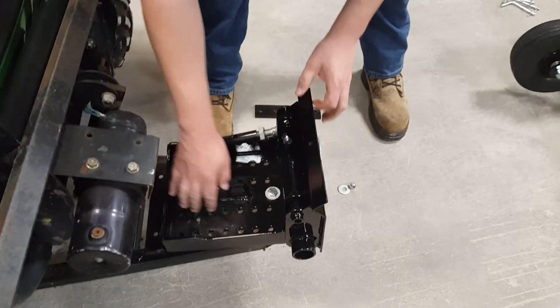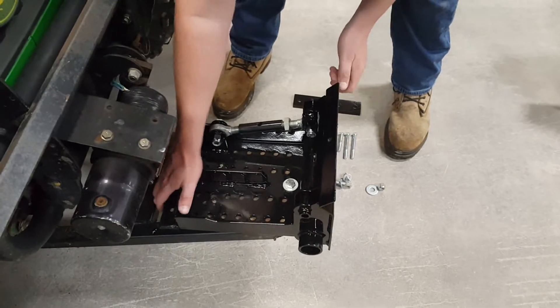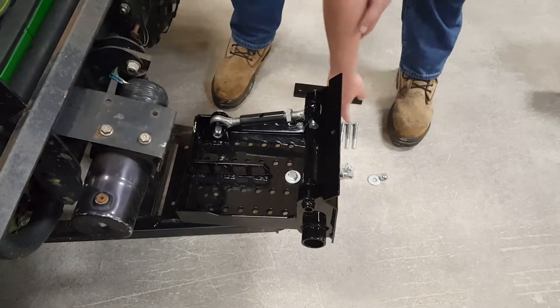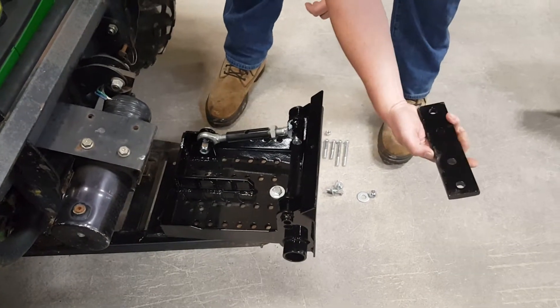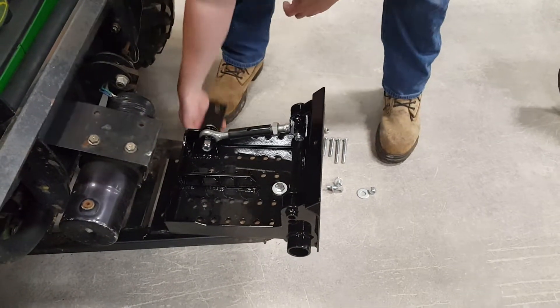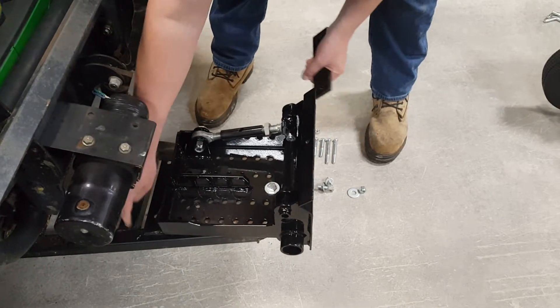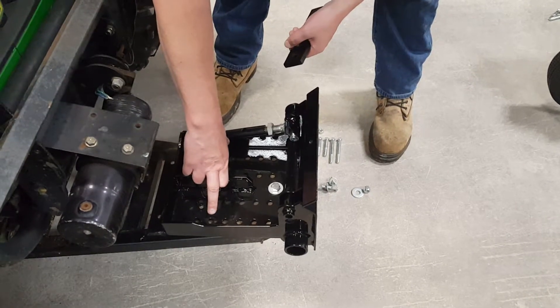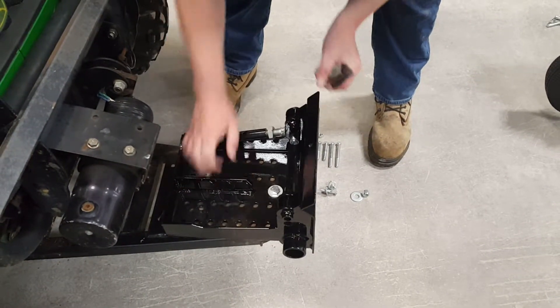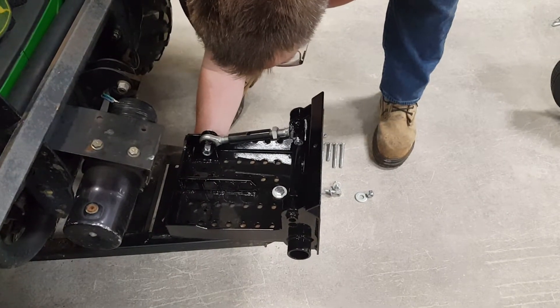You'll see that there are various holes in this part, and you want to bolt this bracket up fairly securely — that's why we've provided you with some different lengths of 3/8 bolts. We've also got this bracket here that you can mount underneath if you need more thickness, or if you've got a narrower snow plow frame and you want to get the bolts a little bit wider for more stability. We've supplied this bracket which can go underneath, sandwiched together.